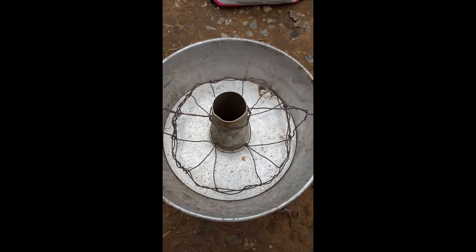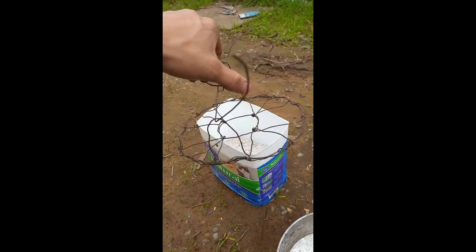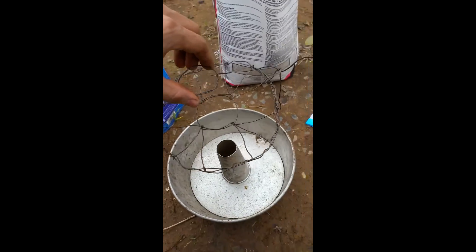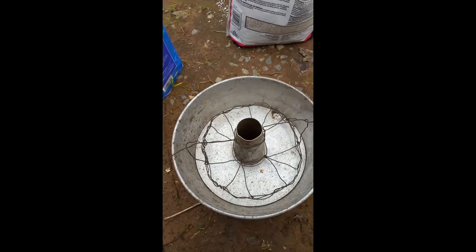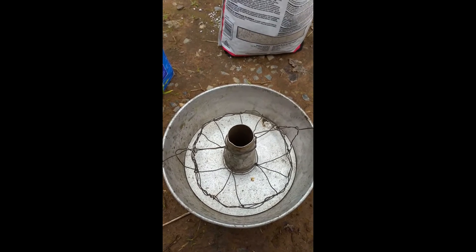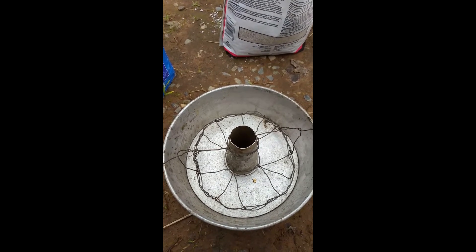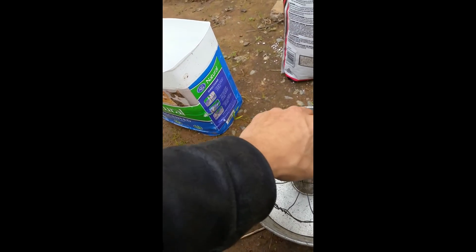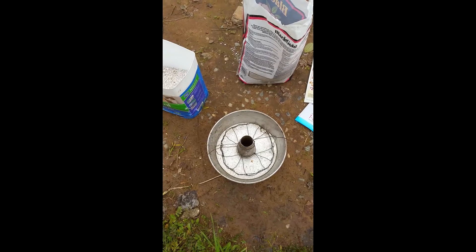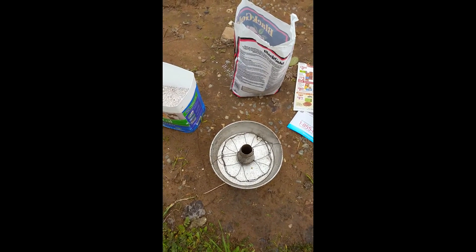Now we'll go ahead and start assembling pieces. This is the wire that I'm going to be using for some structure inside the lid. I wrapped it around and got the basic outer diameter shape. I may make some better handles for it, either welding some onto the wire protruding from the top or whatever. The main purpose is so that I can lift up the lid. I'll also coat the inside because I don't want any wire exposed except for the two handles through the top, and I'll probably coat the inside of the mouth a little bit thicker with some of the extra refractory.